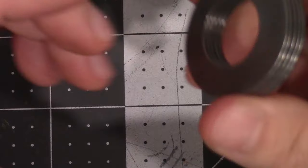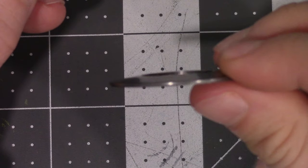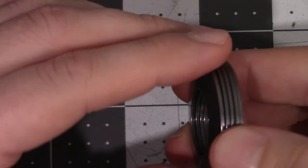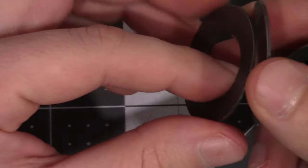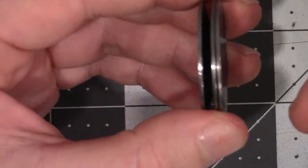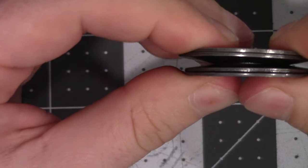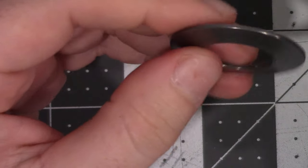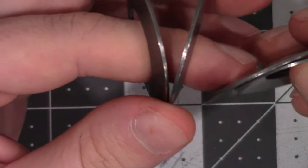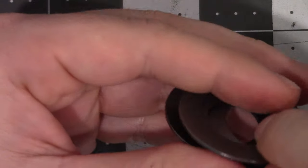So I'm gonna cut in here real quick and talk about these washers, seeing there's something most people haven't probably ever seen. So you can see, they got a slight dome to them. They're not just domed washers, they're actually Belleville spring washers. So you take two and put it together like this, you got a certain spring force. You can stack them up like this. You have really stiff spring force, but not very much travel. But if I take these same four washers, flip one, dome facing this way, dome facing this way, flip that one, oops, I did something wrong here. Yeah, that way, that way.